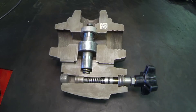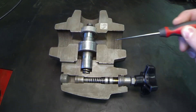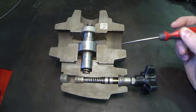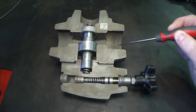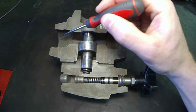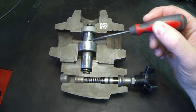Let's continue our section on pressure control valves. We're going to take a look at the pressure control valve in front of us here, and it is a pilot operated relief valve. Let's look at the ports first. This would be where our system is passing through. A relief valve is always plumbed draining into a parallel or alternate leg. So our pump flow could be on one side, our system load on the other, and this would be our drain port that goes back to tank. As our pump creates the flow and the system creates the restriction, that pressure is going to build up in this cavity.